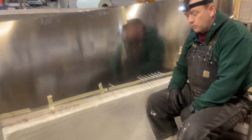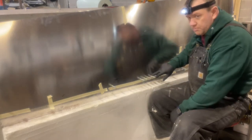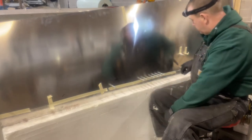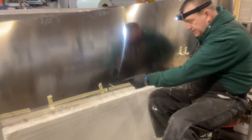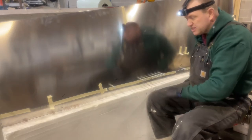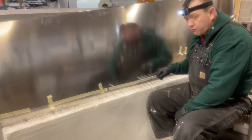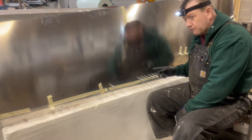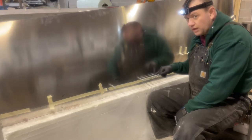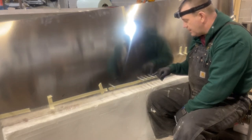This method is working really well. I drilled rib number five and rib number three because I can't get to rib number four due to the bell crank. I dropped my center line across those two and carried it all the way out - looks pretty much perfect. Then I drilled rib number four from the front side since I couldn't come from the back. Double checking on the back side, it looks really, really well - pretty much perfect.